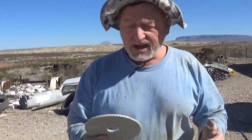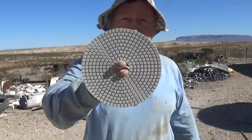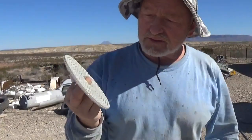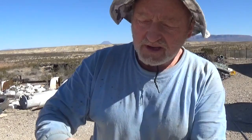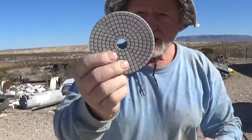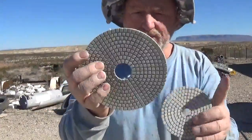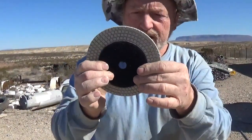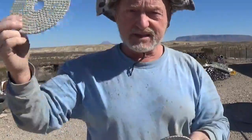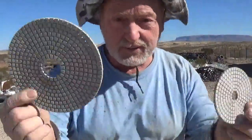I make a lot of mistakes because I'm trying to think too far ahead. I bought these six-inch pads by mistake and also three three-inch pads by mistake. Can't use the three-inch, but the six-inch I can use. When you get it centered, you've got this much hanging out. When you're putting pressure on the pad, you can sometimes create little valleys and ripples — especially true with the 50, 100, and 200 grit. This doesn't create ripples because even though you're pressing hard in the center, it softens out here. So if you're going to get one, get a four-inch or six-inch, but kick up the pads to the next size — that's a voice of experience.